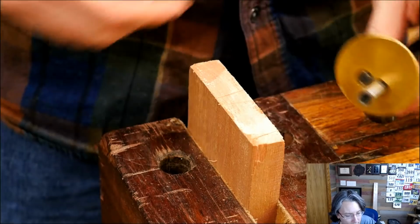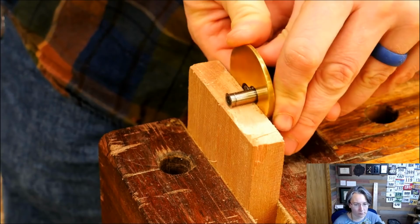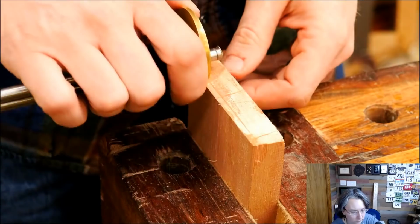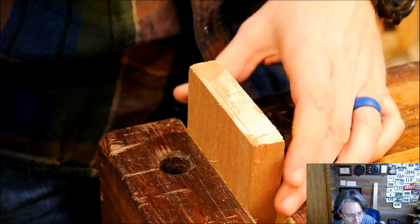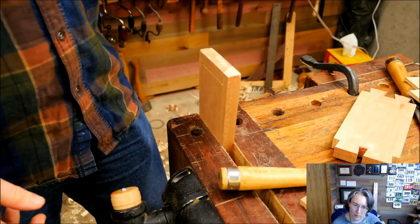Nothing special. Just want to put the marking gauge on there, mark, hold it down, and then I'll put a mark across the top. Now what I did last time is rather than putting the mark here, I turned it around and I put the mark here. And it doesn't work, because you've got to turn this board around to make the cuts. So I'm actually going to turn this board around in the joint. I want it to be up as high as I can so I can get the dovetail in there. And then I'm going to grab the dovetail saw here